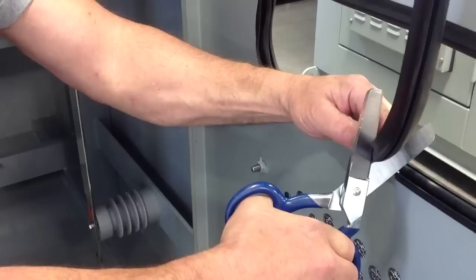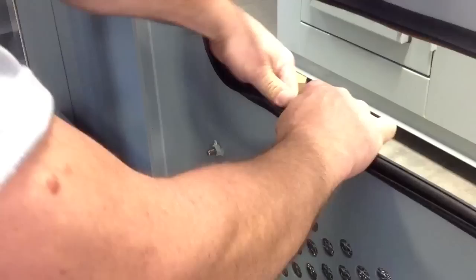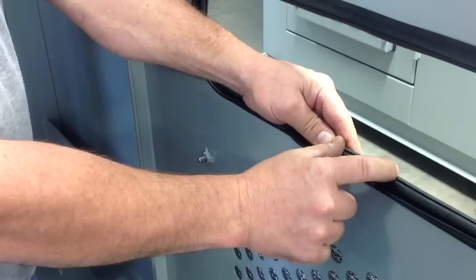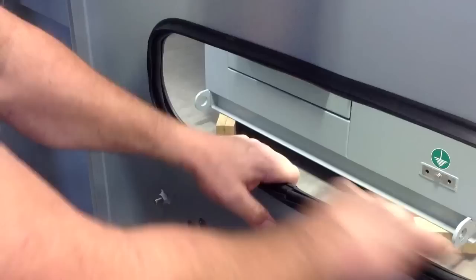Then all you've got to do is just take this back and force it on the head of the other piece, and then push your difference in. If you have too much past, it's going to keep popping off because you're trying to force too much into it. It's about a half inch — at most. If you don't have enough, it'll have gaps in the wintertime.